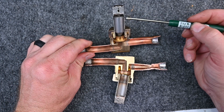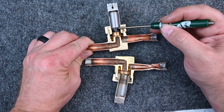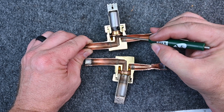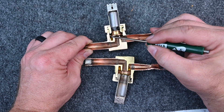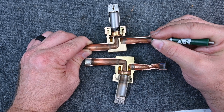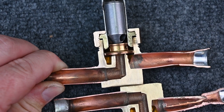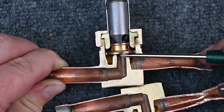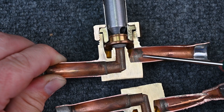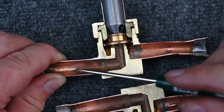When we put our magnet on here, it's going to pull this pin up — and it doesn't have to move very much. It's just moving this rod, this piston. The high side has the majority of the pressure, and that pressure pushes this up the rest of the way. So it doesn't take much to make this open and close. When it opens, it allows the refrigerant to go around this pipe and continue on where it needs to go.